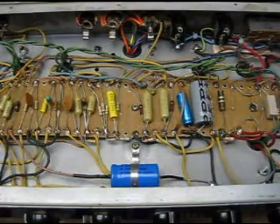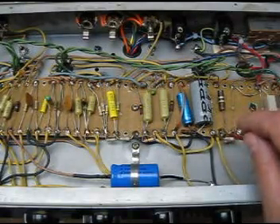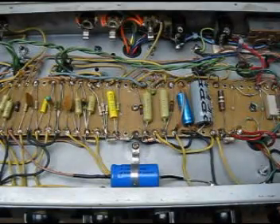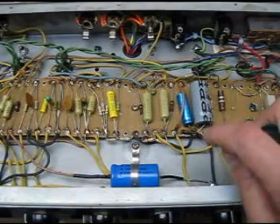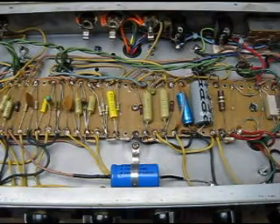Changed all the filter caps but I've gone to much lower filtering than the factory specs, and that's on purpose because I want more of a tweed type sound out of this amp. People occasionally email me and ask what difference does filtering make, and this should give you a good illustration.